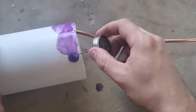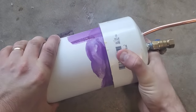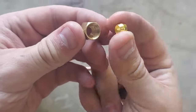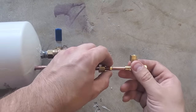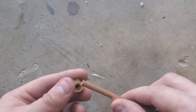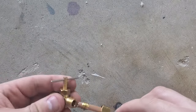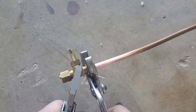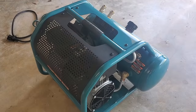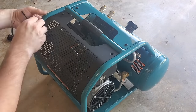This is also an important component for removing moisture from the air, which will be extremely important for some projects I'm going to be doing in the future. I've basically made a small holding tank for water out of PVC pipe, which a 25-foot copper coil sits inside of. The compressed air travels through this coil and cools down in the process. It should also condense a lot of the moisture out of the air, which can be captured before it goes into the tank — this is really helpful for keeping the tank from rusting on the inside.